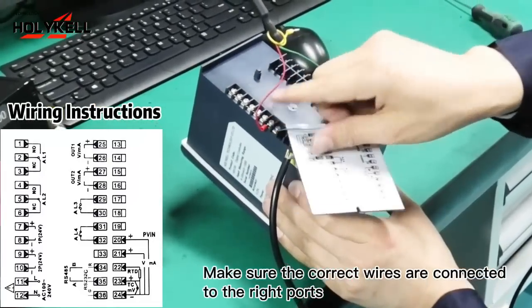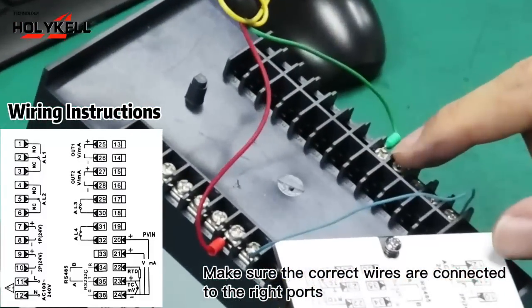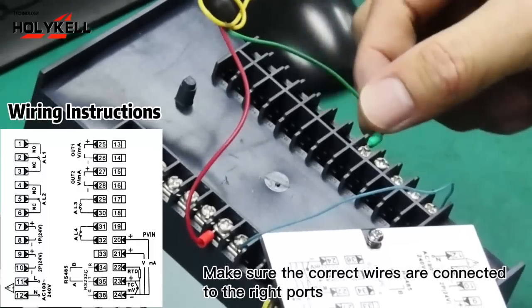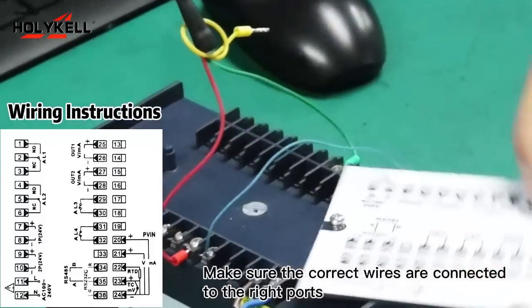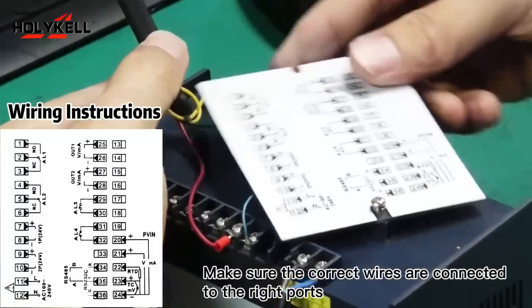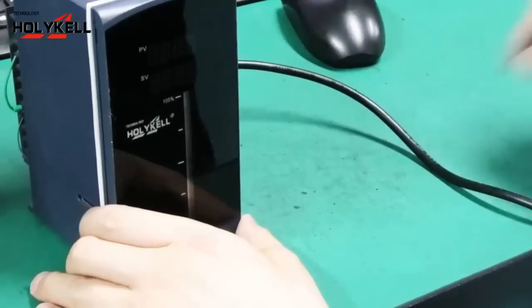The sensor connection is now finished. The blue wire short-connects port 10 and port 24. Port 9 connects to the sensor power wires, and port 20 connects the green wire carrying the 4 to 20 mA output signal into the meter. All wiring connections are complete.